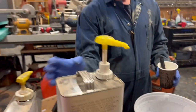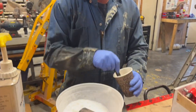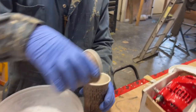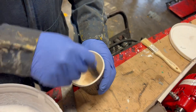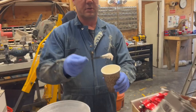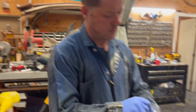Just 105 and 205 epoxy. This is anti-sag — I think it's colloidal silica, that's what it actually is. We're mixing this up to the consistency of peanut butter. We're going to use it to cap all the air bubbles out before we lay down our cloth. We'll check it — see if it sags. It's not sagging, so it's pretty much just the right consistency.